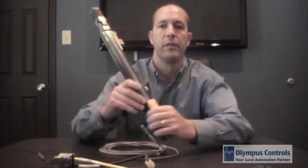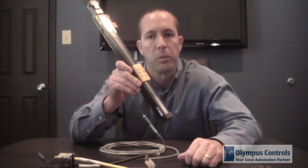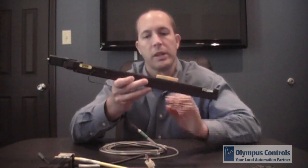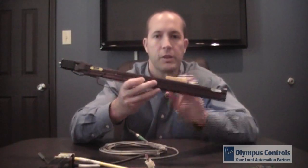Looking at the screw drive, the square rail version has 0.1 millimeter repeatability and the slide pad bearing version has 0.2 millimeter repeatability. We can do 2 G's of acceleration and up to 150 millimeters per second with the larger lead screw.